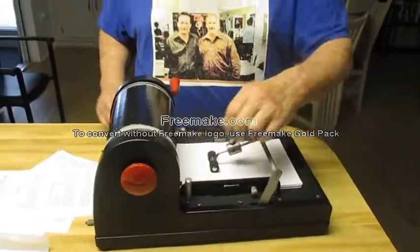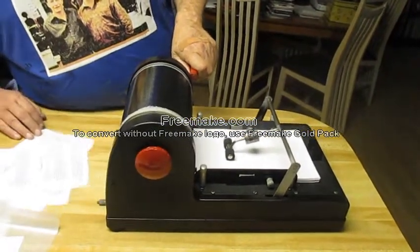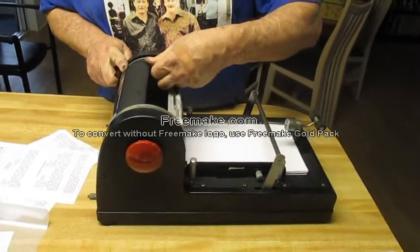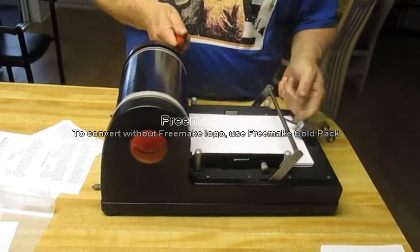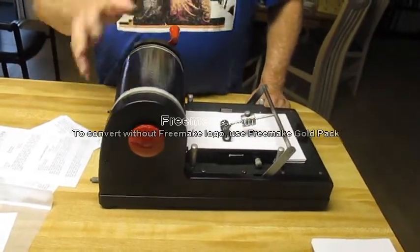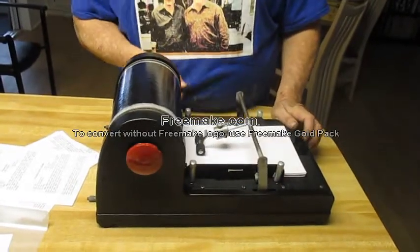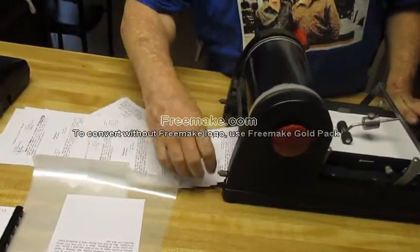When I inked this, I didn't know how much ink to put on it because I didn't know how much it was going to need. I think I'll still raise this a little more because I really want it to the top — I put it all the way now. If you're mimeographing something with a lot of dark print on the top of it, print it upside down when you copy it. Put the dark part on the bottom, because if you put the dark part at the top and you go to print, it will all stick to the drum. And it's coming out very nicely.